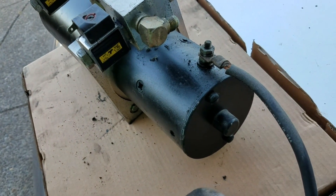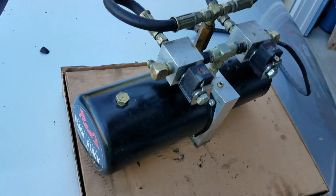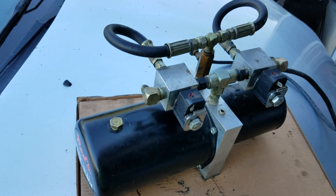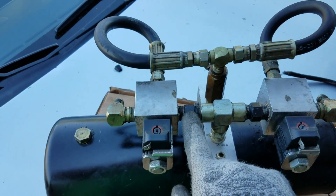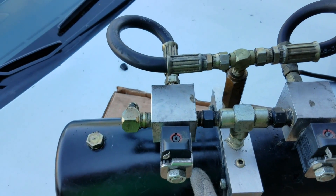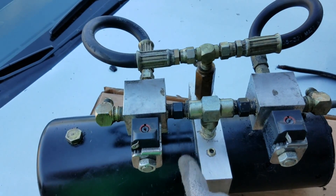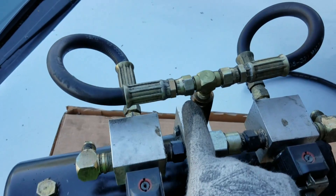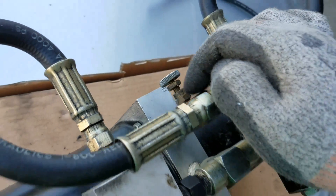Vented caps — trust me, you'll save yourself money. That's it for today. In another video I'll show you different ways to do plumbing, probably on a dry erase board. Always make sure your check valves are put in correctly in the right direction. If they're not, you're going to hurt your pump, your gear head, or break your spline key — the thing that connects your motor and the gear inside. The slow-down valve has no correct direction, you can put them in either way. They make different sizes of these. Don't forget to subscribe and like the video — peace.